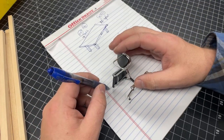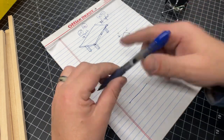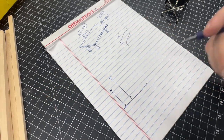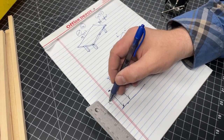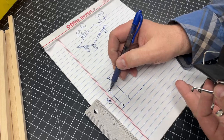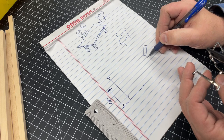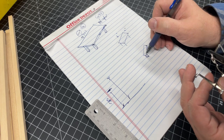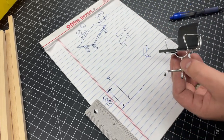And then it's good to know your seat height, and then know the armrest height. That's very, very important. So you need to know the armrest height and the booty height. And if I just get my ruler out, in 1/12 scale, our booty height is 1 5/8 inches. So if you're making a bench, you don't have to worry about the arms. You can make sure the top of your bench is at 1 5/8, right? A simple bench with some little legs, then your actual floor to top of bench should match 1 5/8. Your arm height though, you want that to go under the table.